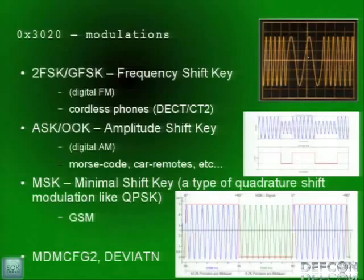Your ASK, and also another well-known one that's used for everything, called OOK. It's a special form of ASK. So why don't you ask me a question? What's OOK? On-off keying. Yes. So amplitude shift key, as you can see in the picture, has high power fluctuations of waves, and then lower power, and then high power and lower power, which is why it's more susceptible to distortion, because the power tends to fluctuate anyway by, you know, a passing wave of solar activity or whatever.